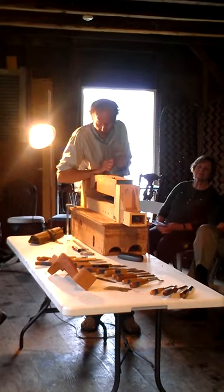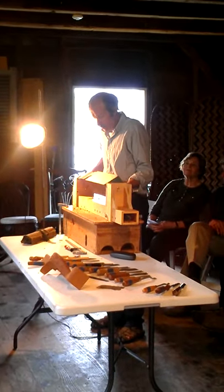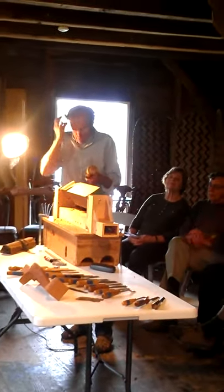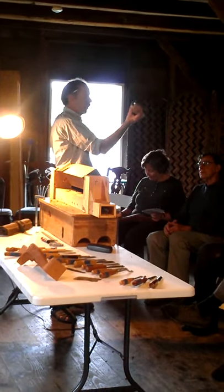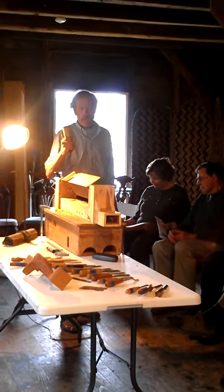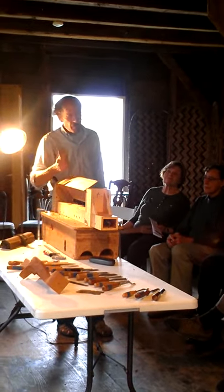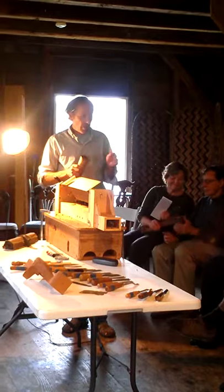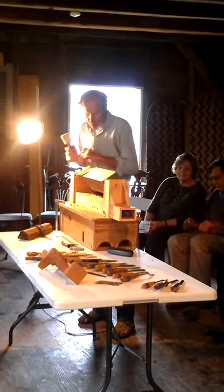The other thing you need to do when you're carving is be able to use either hand. I tend to like light mallets that are balanced. See how big the handle is on this one — it's got a big fat handle relative to the mallet. This way I can just pivot it with my fingers and flick it. If you have a mallet that's too top-heavy, your wrist works too hard. Most people I teach come with big giant mallets, and I tell them don't use that. It's more finesse than brute strength.